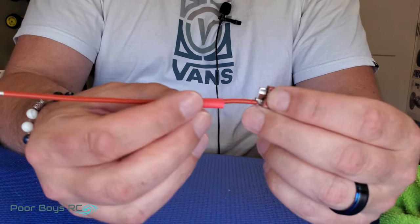So I just grabbed another random wire — it happens to be a female bullet, strictly for illustrative purposes. I'm going to show you guys just a little bit of a different way to solder this. What we've done this time to make this joint a little bit different: the wire basically butts up to the back of that little metal tab instead of being on top of it. That's the difference between these two joints. I'm going to get a little more solder on here and bridge that gap, get it nice and warm.